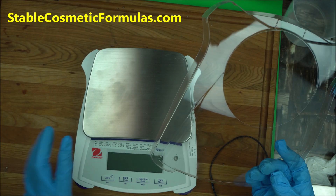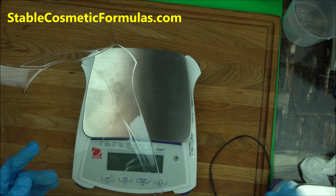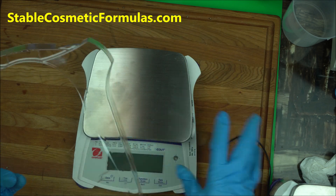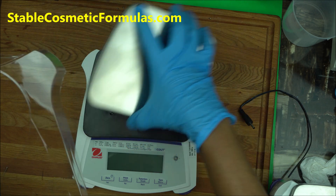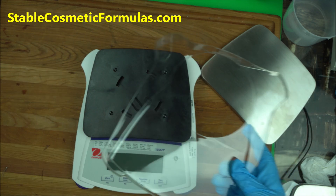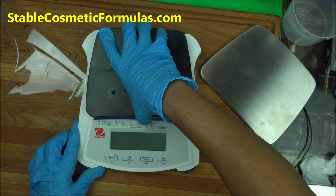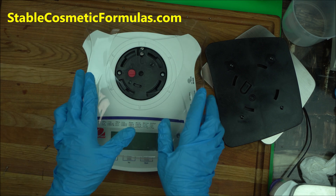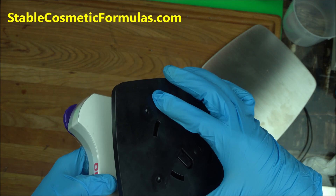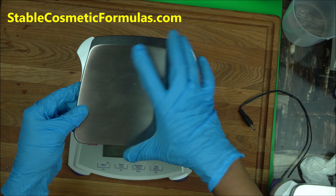Place the weighing pan on top. Now here is something that will lengthen the shelf life of your scale — this scale can last you more than 10 years if used properly. I have a link in the description box for where you can buy all of this. Install the scout cover, which does not come with the scale and must be bought separately. This prevents water from gaining access to the scale. Turn and pull up, put your cover on, and place the pan on top.